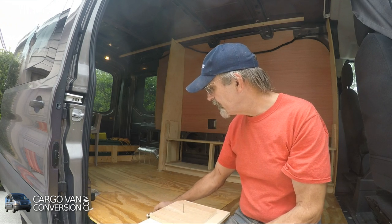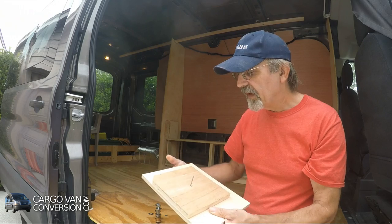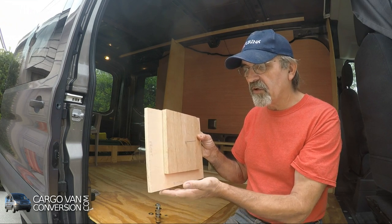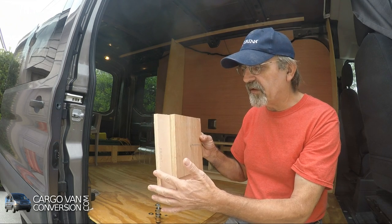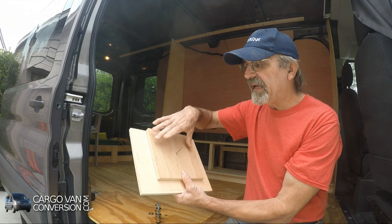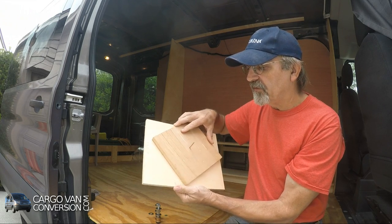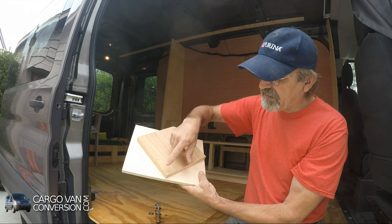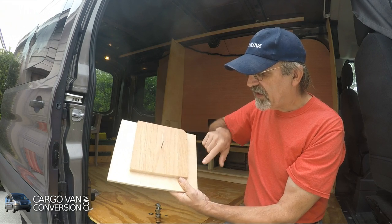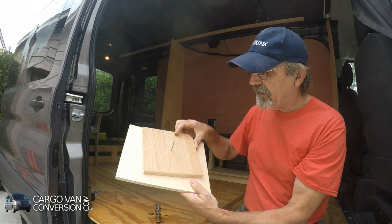I made a very simple mock-up, located with bottom and front. This is more or less the location of the top of the lower cabinets, and that's the front of the lower cabinets. And this is, in fact, the side of the bottom of the bed. And the bed has to turn, of course, open and close. So you can see that this stays just shy of the top of the lower cabinets, as well as the back staying far away, hopefully, from the back wall.